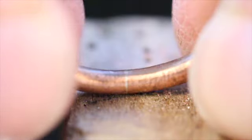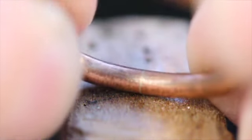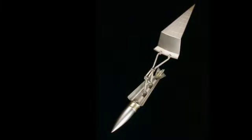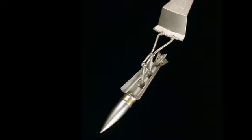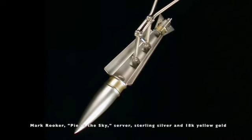Molten, these alloys are even more hyperfluid than soft solders, not only wicking through the joints, but actually seeping into the crystal structure of the parent metal. This results in much leaner seams from which all the solder outside the seam can be removed without a significant loss of strength. While not as strong as a welded or fused joint, a hard solder seam is much stronger and cleaner than a soft solder one, and perfectly suited to the scale and craft expectations of jewelry.